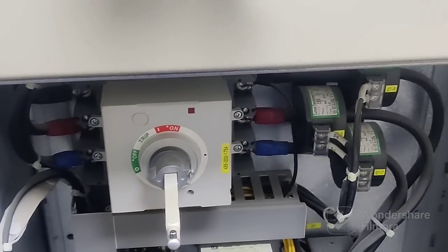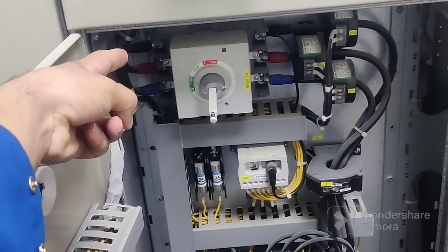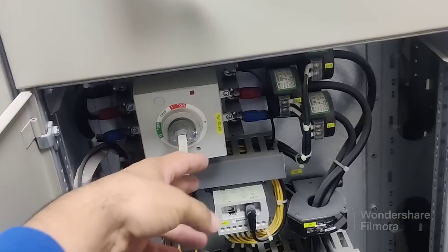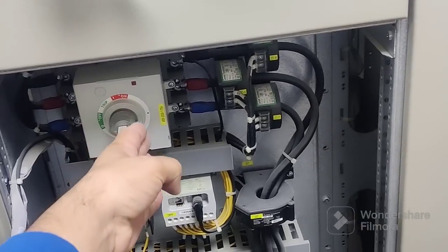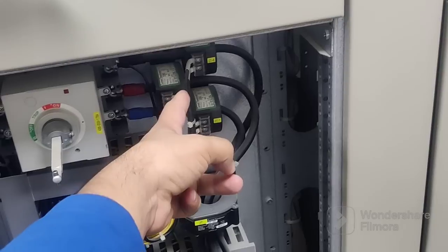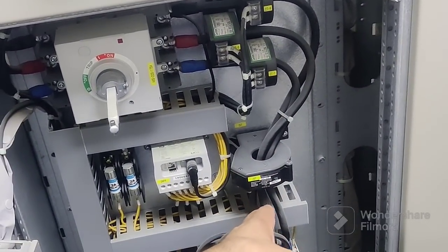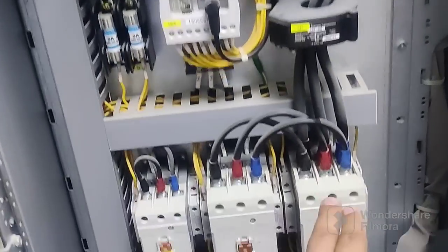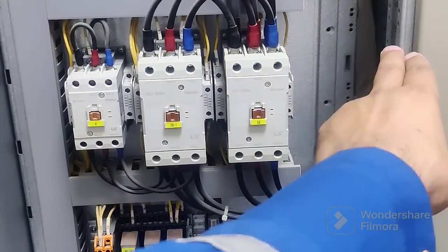So I think it's very simple. Three cables are coming here to the main breaker — ABS 203 or 175 ampere. After this, three cables are crossing through the CTs, single per line, each crossing through its own CT. These three cables are coming directly to the main contactor, and after the main contactor they go directly outside to the main terminal box and to the field.